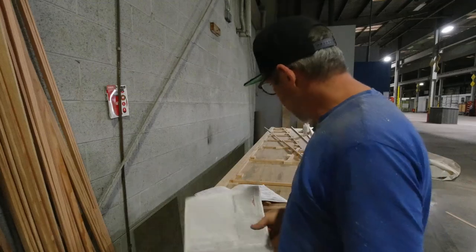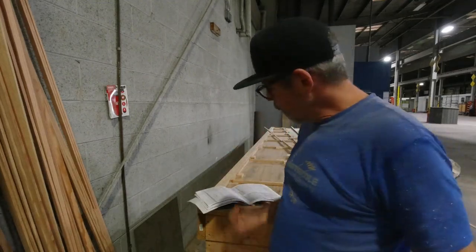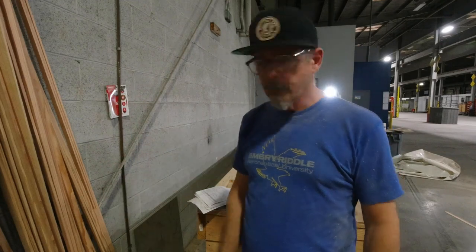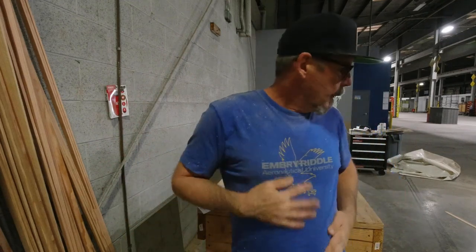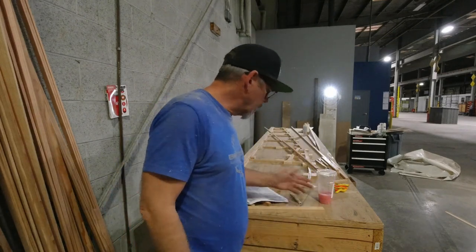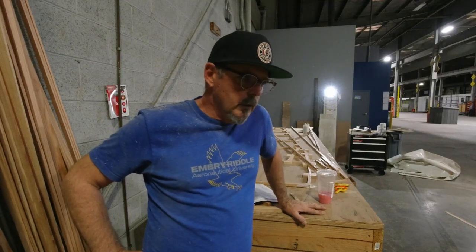So when I'm getting ready to move to drawing number 4, I can look on there and I need 338 inches of 5/16 by 3/4. I have 3 pieces at 144 inches, so I have more than enough of that. But it's really a lot of really good detail. If you're a scratch builder, it just makes it really nice because you're not cutting up a bunch of material that you don't need. You can keep track of how much you actually do need. And the plans are just easy to follow, simple instructions, very few things are head scratchers in there.